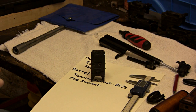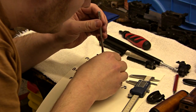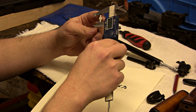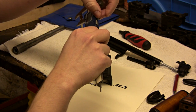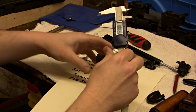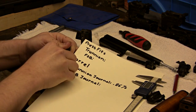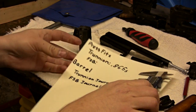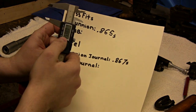Check your reading again because you want to be able to reproduce it. I was able to reproduce my measurement again, which is .8655. We're going to write that down for the trunnion — that's the hole in the trunnion. I'm writing that five small because that's how you see it on the micrometers; it's actually just the next decimal place.